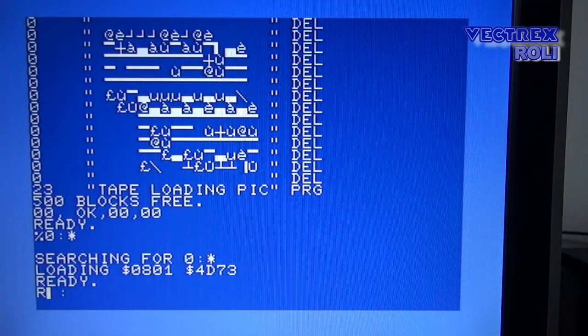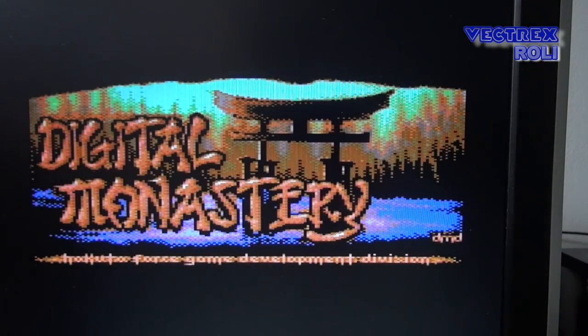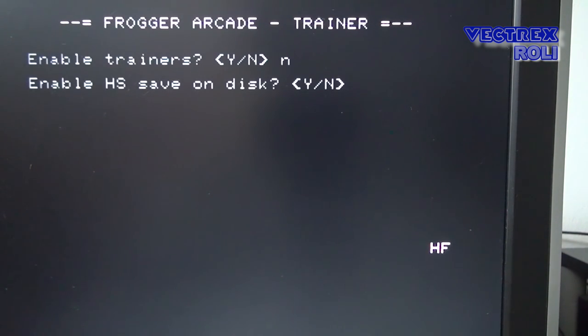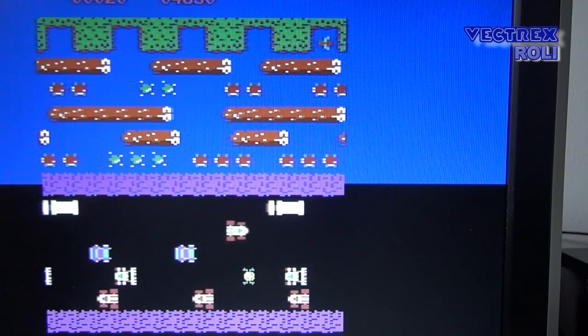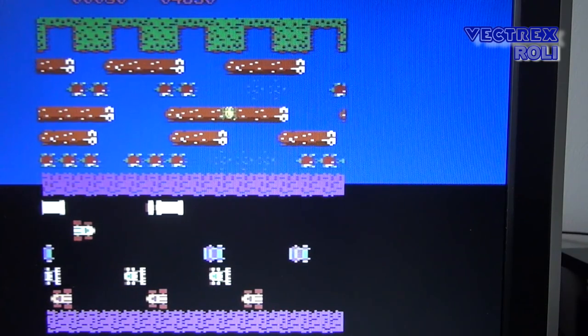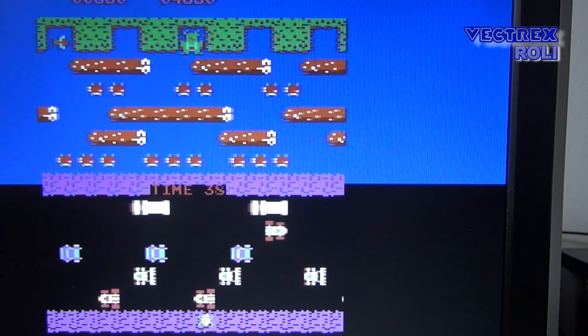You know, different users prefer different speed load solutions. As I never had a C64 back in the days, I was never really diving into the topic, so for now I'm happy with what I got with my Ultimate. You can use your 1541 Ultimate 2 and 2 Plus also in C128 and CP/M mode, so it basically behaves like you would have connected an original Commodore 1541 disk drive as an external drive on your computer in all three modes of the C128.